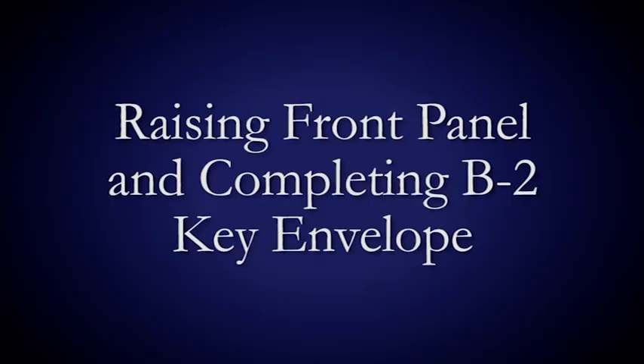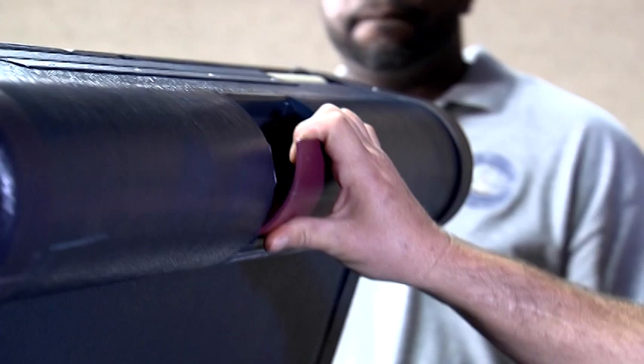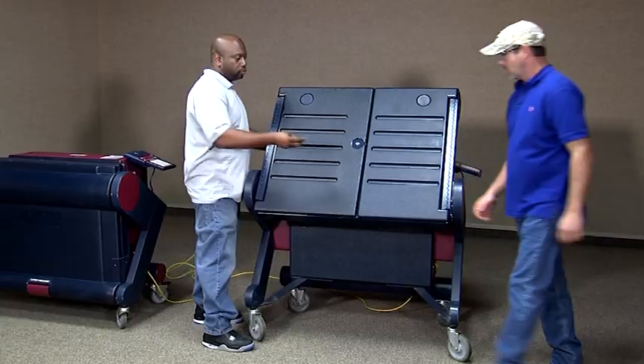Raising front panel, completing B2 key envelope. Move to the front of the voting machine and pull the voter panel up in a vertical position — it won't drop or fall. This is the position to use for voters who need to be seated while voting. Now move to the back of the voting machine and pull the maroon latch and tilt the voter panel until it is resting on the back of the voting unit. Move to the front of the voting machine again to unlock the front panel using the yellow capped key.